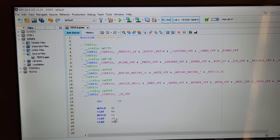Actually, by the way, you see the pink or the red, depending on what kind of screen you have. The pink here says it's not happy with it. It won't complain too much. Always define it as hexadecimal by putting 0 and an X in front of a number that has a hexadecimal digit in it, or hexadecimal number. So I've done that just to make sure I don't have any complaints from the compiler.